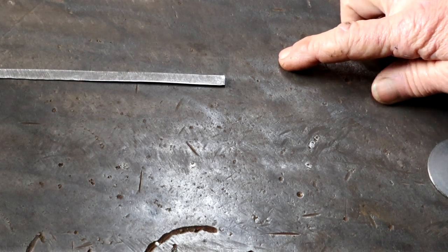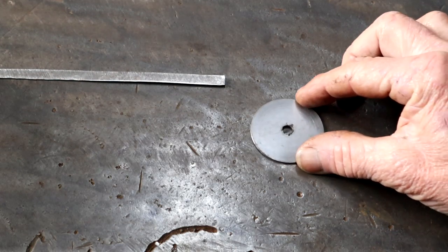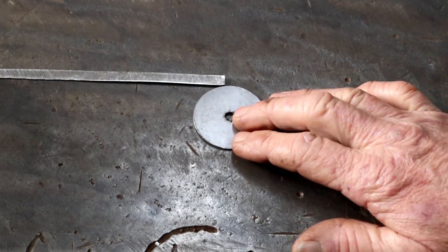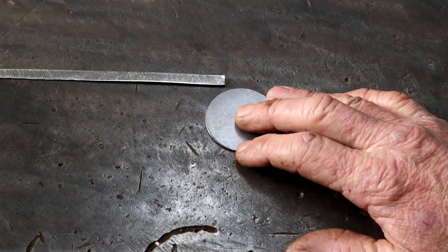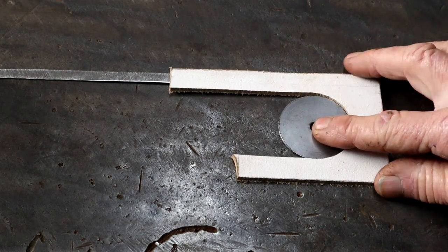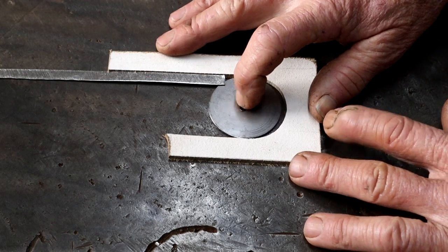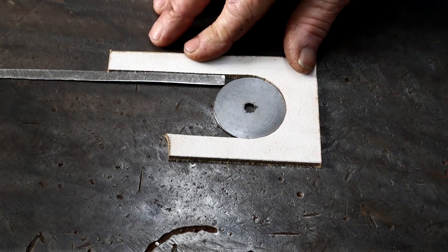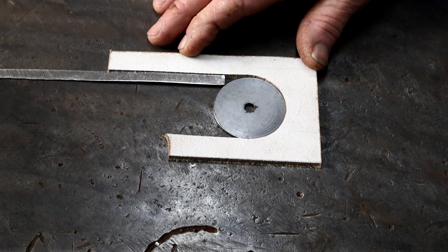Here's how my jig works. Let's imagine this is the sheet metal, and here's my round bar that I want to edge it with. If I freehand it, it might not be consistently the same. But look what happens when I use my little jig — the round bar is held in place, and as I move it in, clamped there, I get consistent results every time because it ends up sitting exactly the same every time.